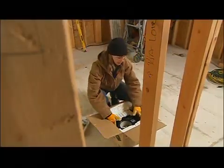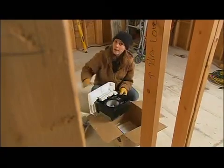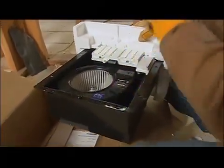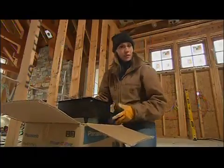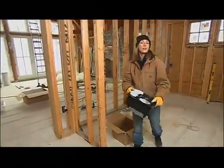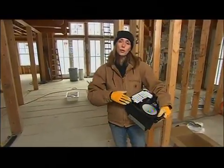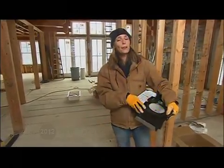These fans are perfect for removing excess moisture in an enclosed area, but fans like this one can also provide a little bit of extra heat. This unit has not only the fan to take away moisture, but also a built-in heater to take the chill out of the air. One nice thing is it's got a real low profile, so it will fit in a 2x6 joist space, which is great for older homes or remodeling situations like a downstairs bathroom. We actually installed one underneath the concrete patio not that long ago.